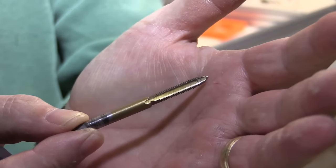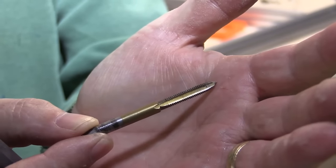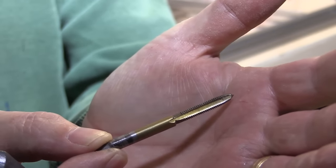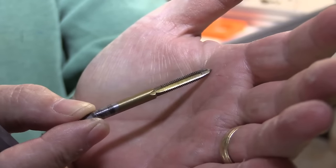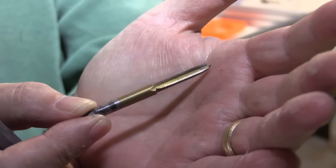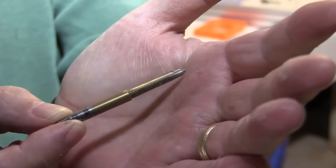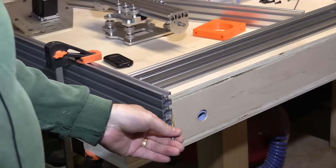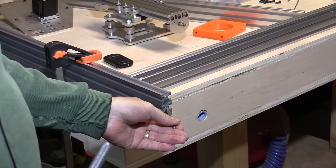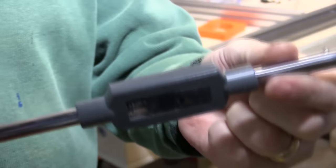What I prefer when doing something like this — if I'm going to have a clearance hole and want to keep tight control on any slop — is to use about a 5.2 millimeter hole, which theoretically the screw will still go through but with a much tighter tolerance. For the sake of tapping, these extrusions are already drilled at 4.2 millimeters nominally, so we just have to tap them. I also have a tap wrench, which just clamps on the end of the tap.